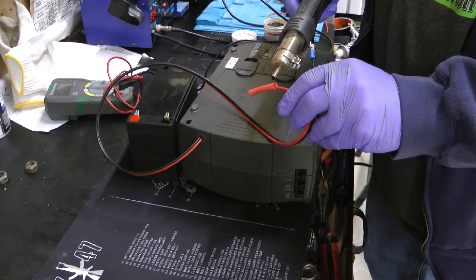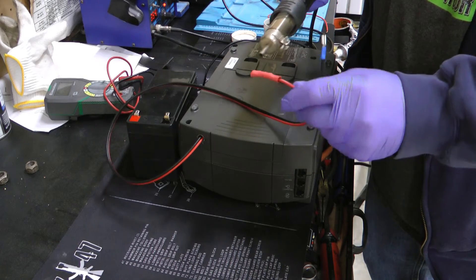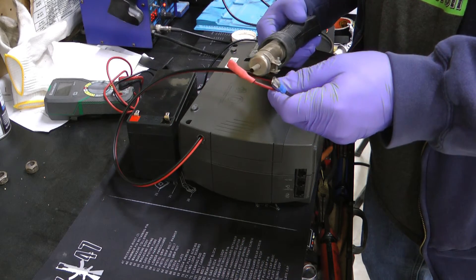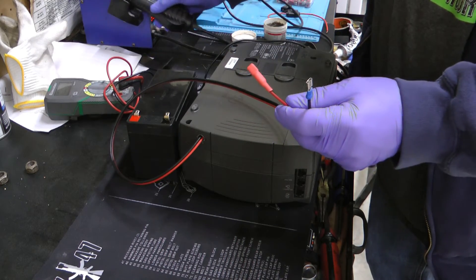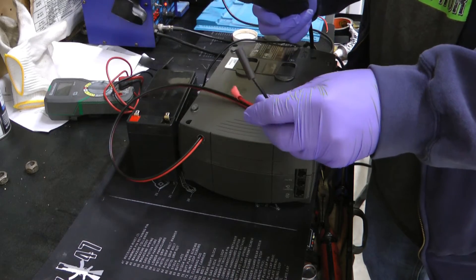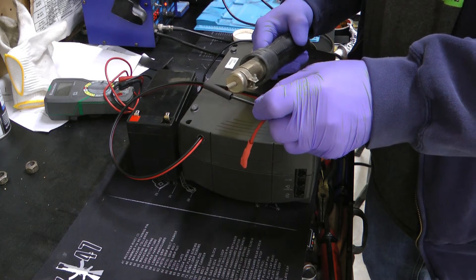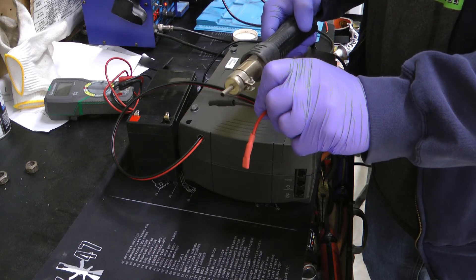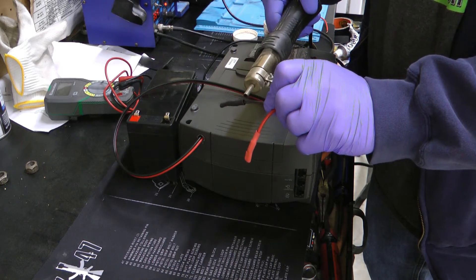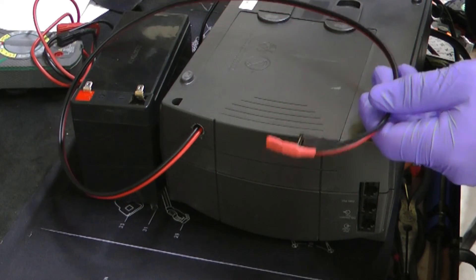If I was using a cigarette lighter it shrinks almost immediately. I like using color-coded wire — black for ground, red for hot — so that you don't accidentally plug in the wrong one. That gives it a much more professional appearance and an additional layer of safety.